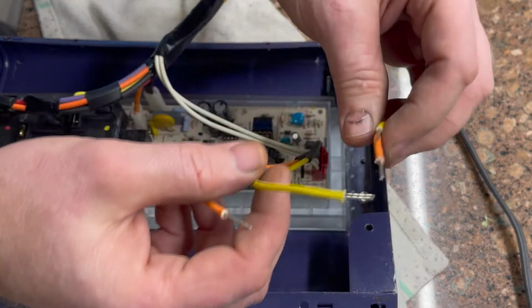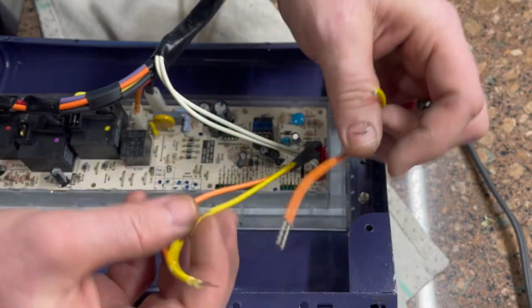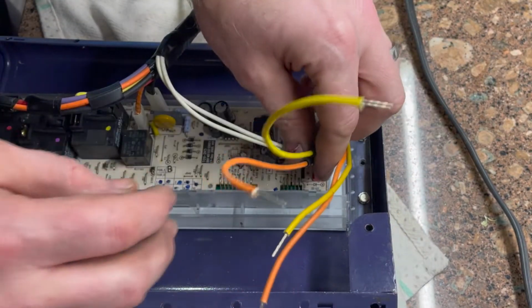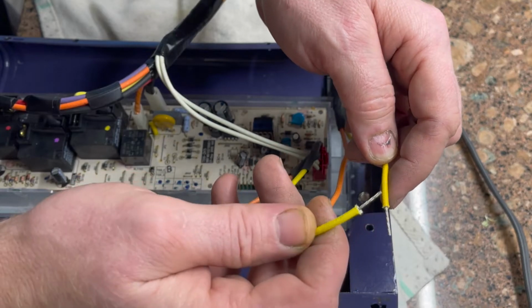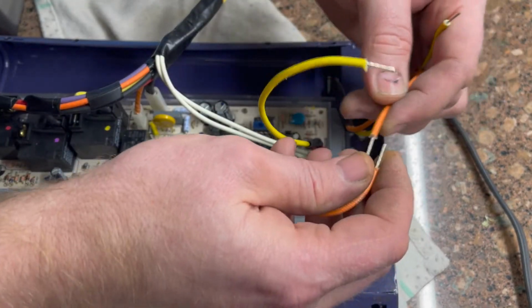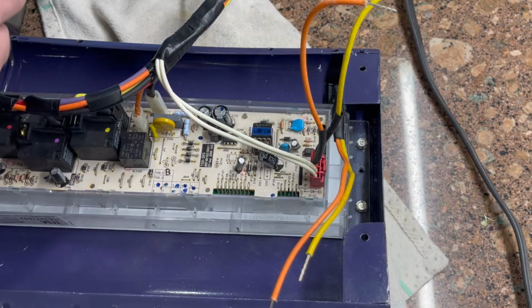While I'm waiting for my soldering iron to get hot, you see right here is that switch, and these are the wires for that. It's shortened considerably. All it really does is go off, on, off, on. Just a simple switch, polarity doesn't matter. Make sure you put your heat shrink on before you solder, otherwise you have to disconnect it.